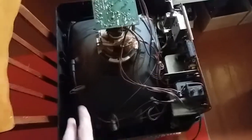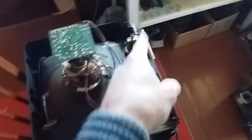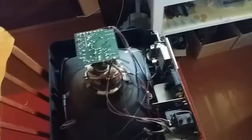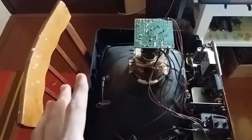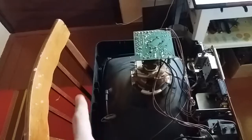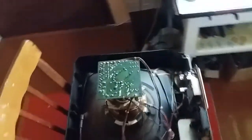The cover is off and the model is, by the way, a KCT 2007D. What I did just after taking the cover off — I took an alligator clip and a screwdriver and tried to discharge the CRT, and I heard no spark whatsoever, which already hints at a dead horizontal output transistor.